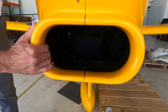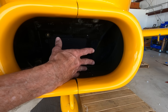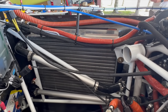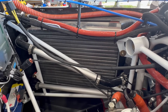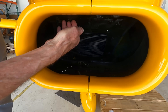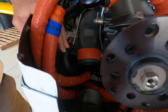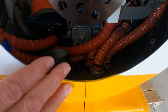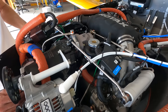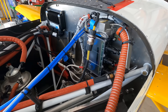You've got the oil cooler in the center. Air going on the right side travels through an integrated channel in the cowling to a very large radiator where we can slow that air down and get maximum heat transfer with minimal drag. The air on the left side of the cowling goes to the intercooler and also feeds the engine. There's an inlet on top that cools the cylinders through the baffle, and then individual lines cool different electronic components on the engine to the correct temperature — that's part of how we keep our cooling drag very low.